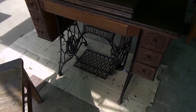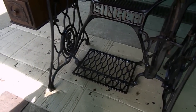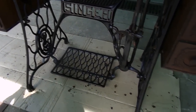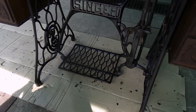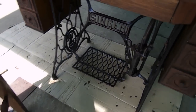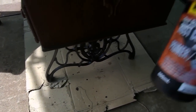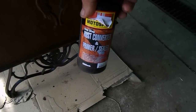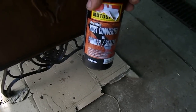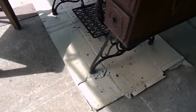Another hour down the track. What I've done is I've just given the base a wash over with a light scourer and soapy water. And I've just given it a coating with something that I use a lot of, which is rust converter, primer, sealer. That's exactly what it is – a rust converter and it is just a primer.